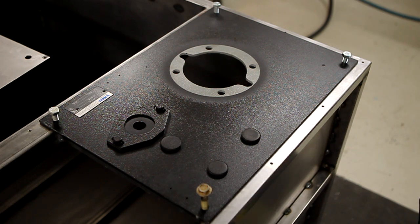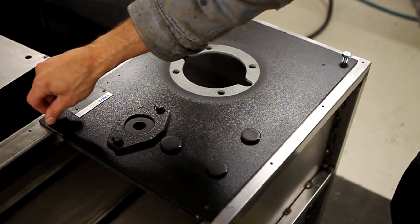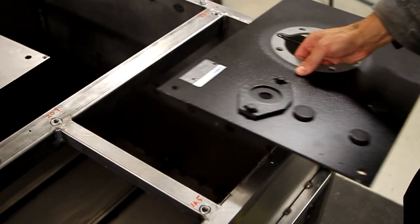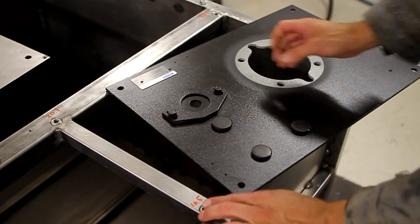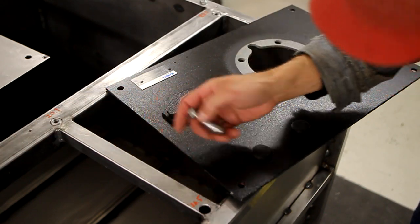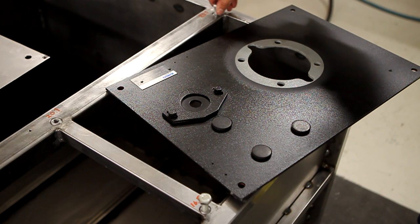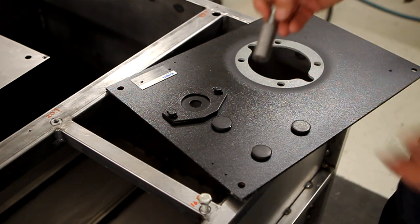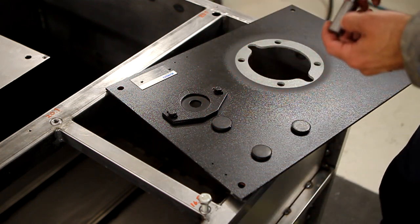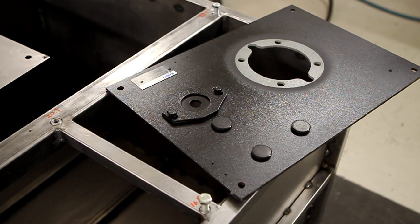So we've got this dry fit here now. There's a little bit of wiggle room. I'm going to go over the inserts — I'm going to weld them in here. This one is smaller than I would like, but it's right up against the edge there. These are better. A little chamfer there.